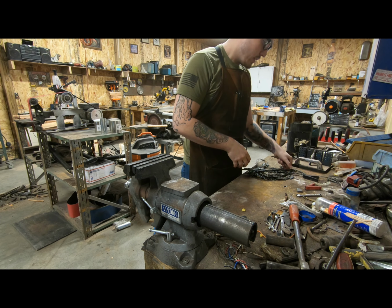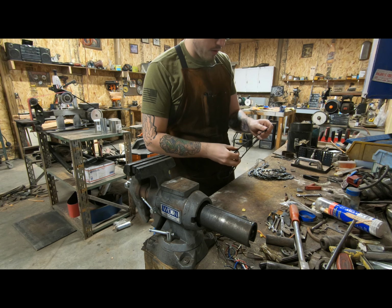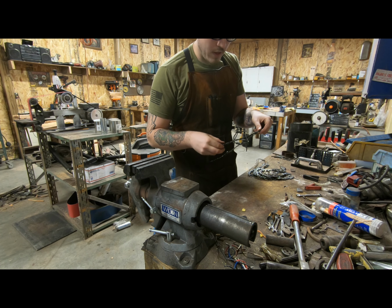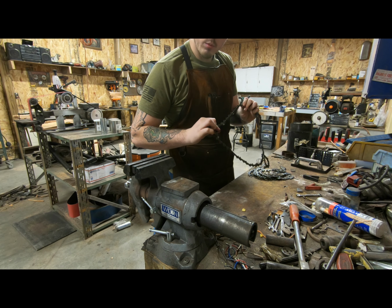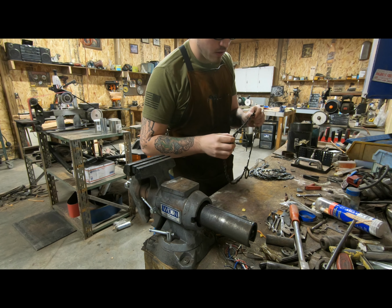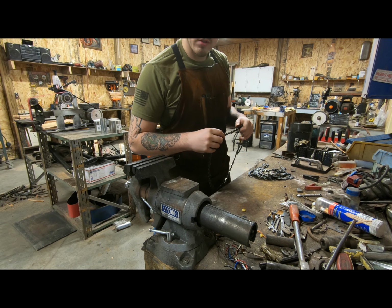All right, so the next step, since I welded those two canisters together to make one big canister, is to cut these to length, stick them in the forge to burn off anything that'll burn off, and then clean them with degreaser to try to get the rest of that grime off, and then stick them in the canister, put the powder in the canister, seal the canister, and be done. I'm ready to squish.